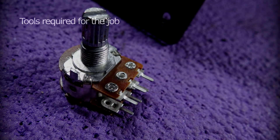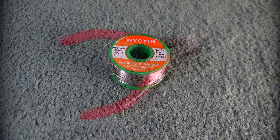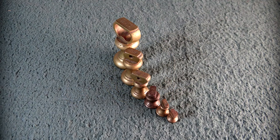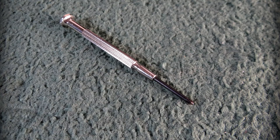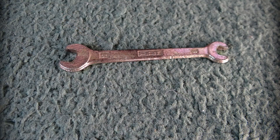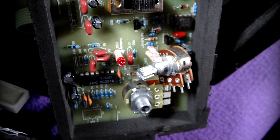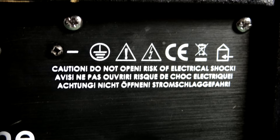For the repair you will need: a 5 kilo-ohm dual-ganged potentiometer with three lugs — it must be linear; a soldering iron, preferably temperature-controlled; solder; small wire cutters; silicone rubber; multi-strand wire; a small heavy weight; foam; a selection of crosshead screwdrivers large and small; and a quarter-inch spanner capable of hex nuts. You will also need to be able to identify capacitors and potentiometers and have some soldering experience.